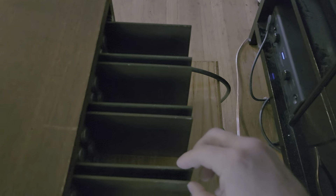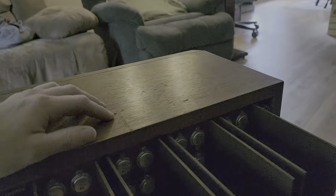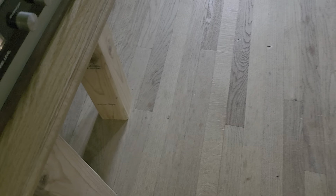It's got these gigantic aluminum cooling fins sticking off the back. Each channel has 12 output transistors, and they're just exposed. I don't think this thing would pass any kind of modern safety certifications, because you can actually feel a very minor electric charge coming off of those if you touch them while the amplifier is on. It's crazy.